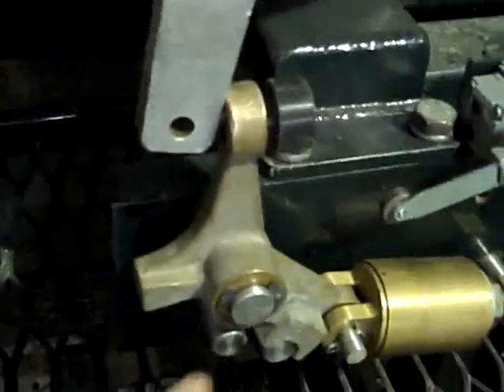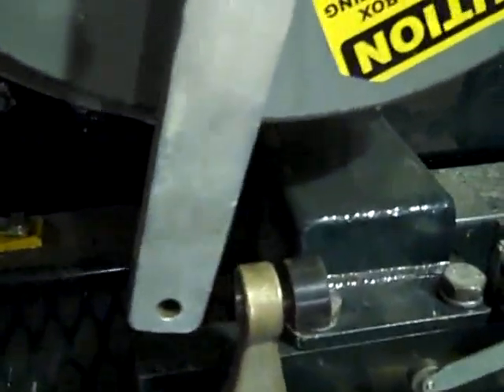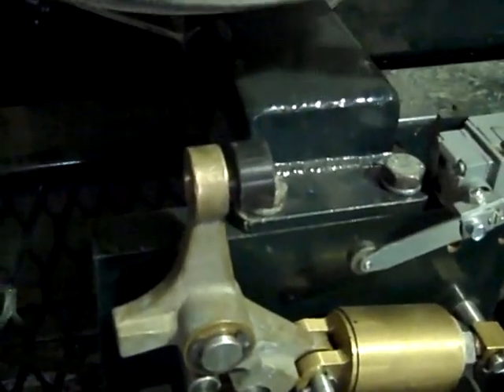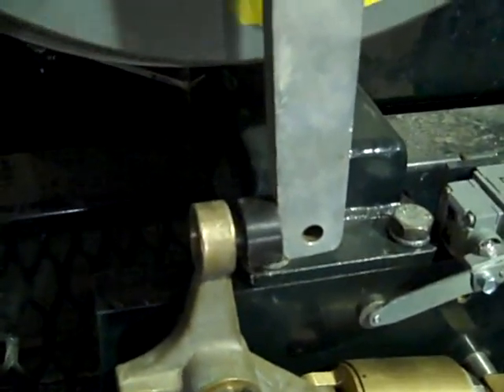Be careful when going backwards because there is aluminum on brass right here, and you can actually snap off the trip assembly. So just roll it until it gets tight, then stop and roll the other way. Once you get 10 revolutions easily each way, that should be enough to be able to start up the centrifuge.